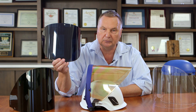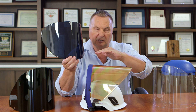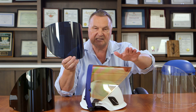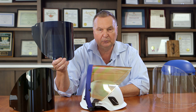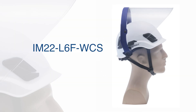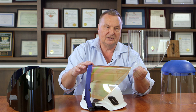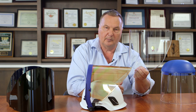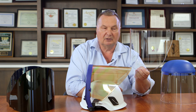Another example is this cobalt blue face shield — IM22-L6F-C5-WCS — a polycarbonate face shield designed for the steel industry, allowing workers to look at molten steel and identify the slag on its surface when it's in the ladle. For more general purpose applications, we have the IM22-L6F-WCS: a clear polycarbonate face shield, 0.060 inches thick, injection molded to shape, perfect for general applications and high heat.